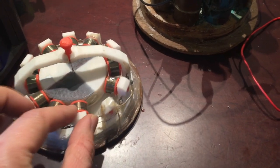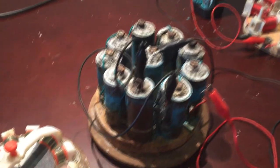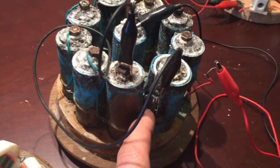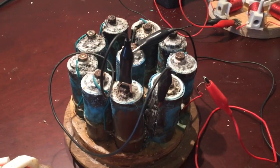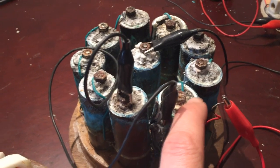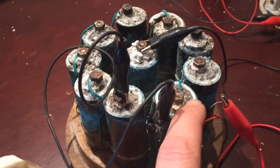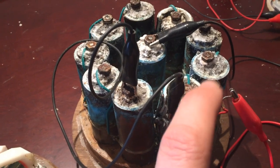The updated design is a little stronger in the way I build these now. I had reed switch failures, and I had major failures on the crystal cells here. I think the reason I had such extreme failures on these ones is that I took PVC pipe sanded down to fit between the copper pipe and the magnesium rod and pounded it in under a lot of pressure.